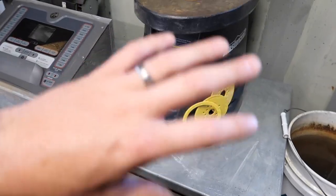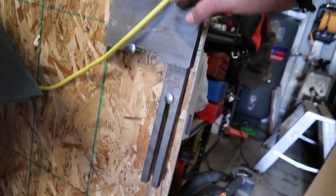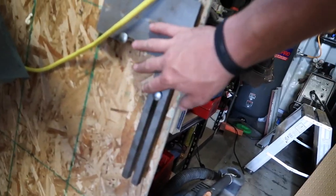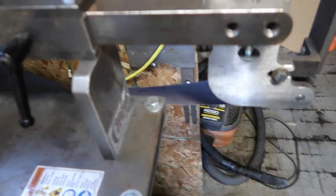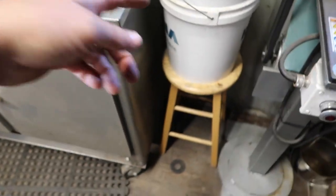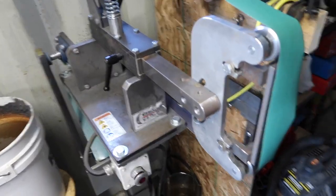This whole grinding bench is completely free and clear, which is really nice. I also used to have to set the work surface for my KMG belt grinder separately — now I just put in two bolts through this plywood, which is a dust protector from the shelving unit, and that keeps it hanging there and out of the way. Same with the 9/16 wrench I always need to loosen and tighten my tool rest — why not hang it there? When I'm ready to grind, I just bring my water out, set it underneath, and I'm good to go.